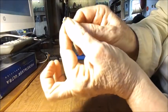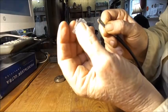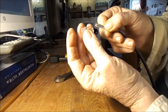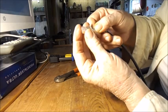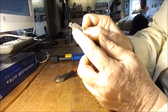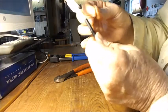So this is the order I want. I have to hold it carefully and check my colors again. I get my cap and I've learned to keep this on the top so you can keep track of it. You insert these and push them upward, slide along the roof, and one smooth push will push them through each hole. Sometimes you just don't think it's going to line up but it will. Go ahead and put it in, give it a gentle push. Now check the colors: white-orange, orange, white-green, blue, white-blue, green, white-brown, brown. The bottom looks a little crazy — this string you could cut off at any time.